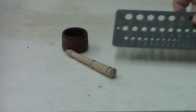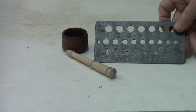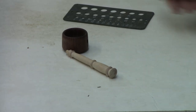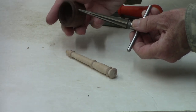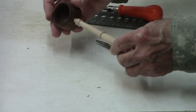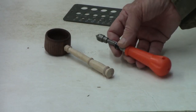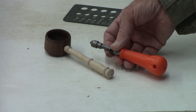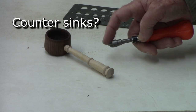Let me show you a couple of very convenient drilling accessories. This is a metal drill guide — I picked these up for free at various places. They're very handy for sizing drill bits and holes. The other trick that's very handy is this plumber's reamer. Works great if you've got a small hole that you just need to open up just a little bit when you're fitting two pieces together and the hole is just slightly too small. Another item I don't use very often, but every now and then when I want to chamfer the opening of a hole a little bit, I've got this hand tool.